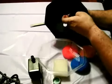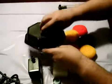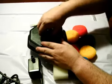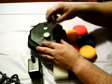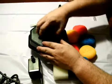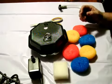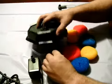One thing, when you run your bead around and you screw it in there, it's going to be loose. So what you want to do is take your top and screw it on, and you want to get it pretty tight. That's pulling everything up, and that silicone will form, holding it right where you want it. Let it set for about 24 hours. Hold on to your cap. You're not going to be through with this cap, and I will show you why in just a few minutes. Alright, so now I got that set up.